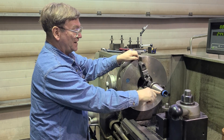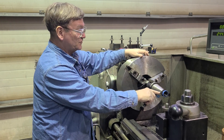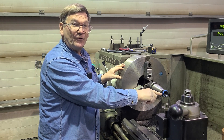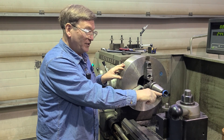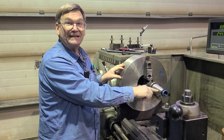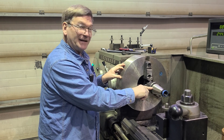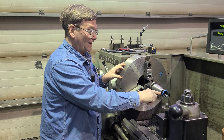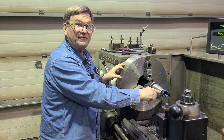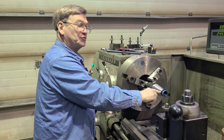Once we got it true at that point, you come out here and see where the runout is, then rotate this around so it's in the middle of the runout. That way, at that point, it would be the same for the angle as where you would be dialed in — without having to actually dial it in. So here you'd have it at zero runout, and here you had plus five, then it runs to zero. You turn this around so it's at two and a half.